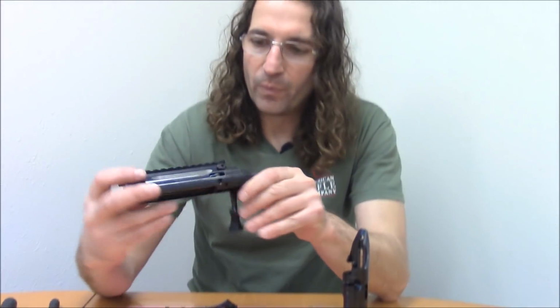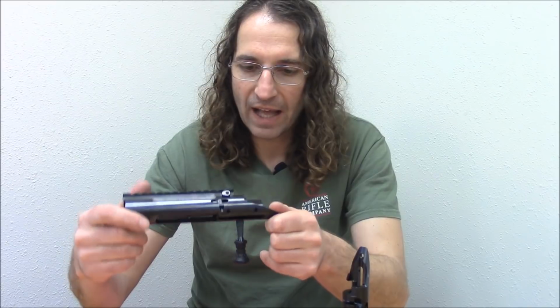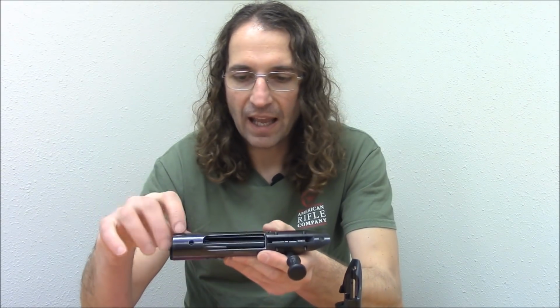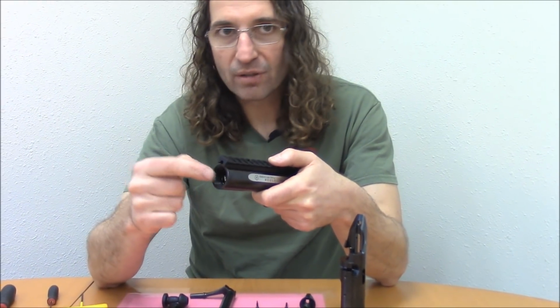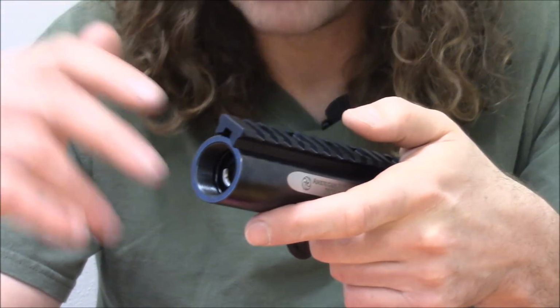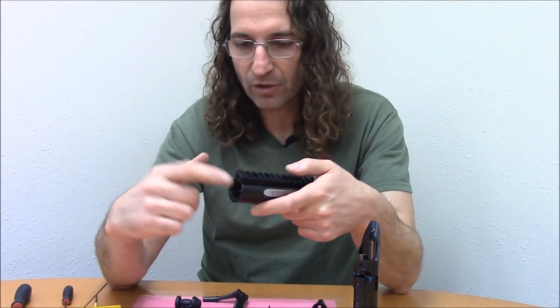So, a brief overview: it is a Remington Model 700 compatible action, meaning the aftermarket goodies designed for the 700 will function within this action, those being triggers, AICS pattern magazines, and chassis systems. The barrel thread is Savage small shank. That thread is 1 1/16-20 unified class 2B properly. Class 2A would be its male counterpart that's found on the barrel that screws into it.